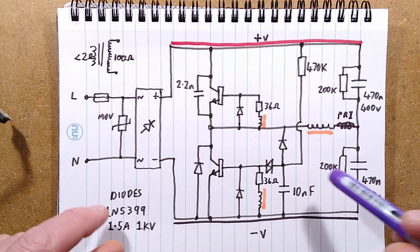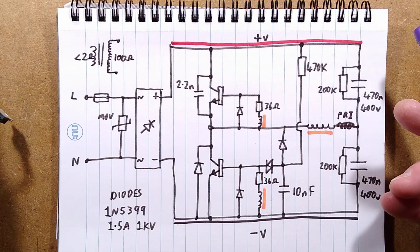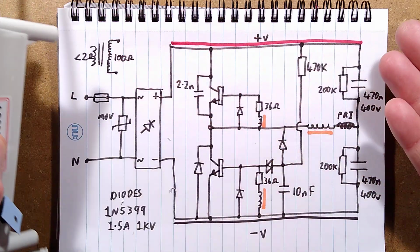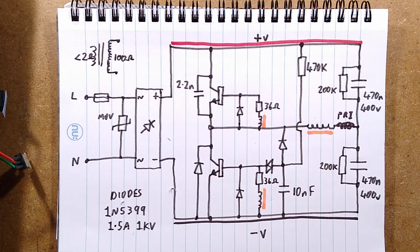I wonder if they've patched these in as things to try and prevent that, because dealing with high voltage transformers is always a bit of a nightmare. When one side gets referenced to ground, you get capacitive coupling that can be quite high voltage, and it wants to find its way back to ground and finds its way through the circuitry.